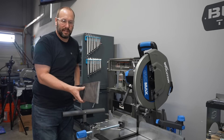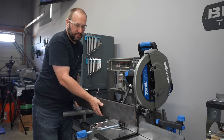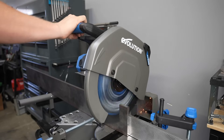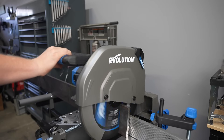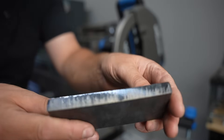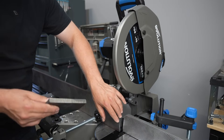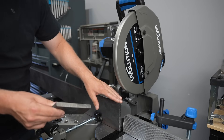Let's start off by looking at the actual cut quality. I'm going to go heavy right out of the gate with some half-inch thick flat bar, and then we'll cut some thin stuff too. That ate through there in a hurry. It's cool to the touch as soon as the cut is done and there's basically no burr on there, which is really the opposite of what happens with an abrasive saw. With an abrasive saw it would have taken about four times as long, it would have been really hot right after, and you'd have a big burr to get rid of. That's really the advantage of the cold-cut technology with this type of saw.